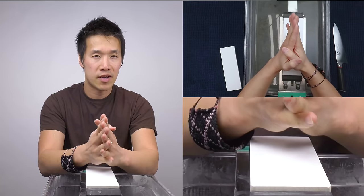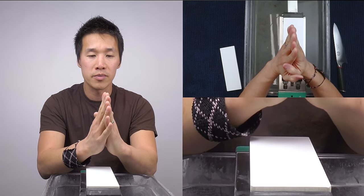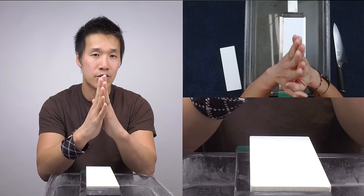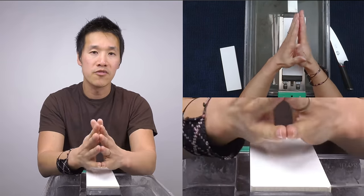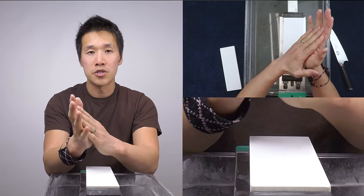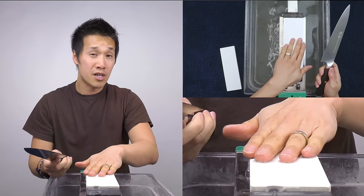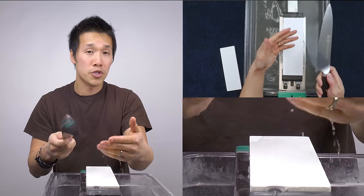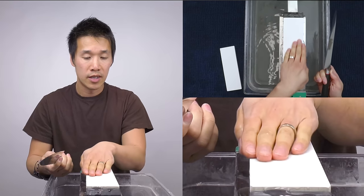This is strictly based on what I know and my own sharpening experience. The first thing: what is a burr? Essentially, a burr is a strip of steel or metal material at the very tip of the cutting edge of your knife, standing to one side or the other, or straight up. When people say 'look for the burr,' you're trying to figure out whether you've sharpened one side of the knife enough — you should feel a lip of material on the other side.